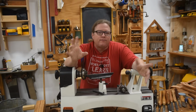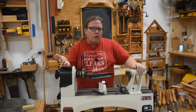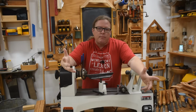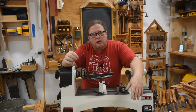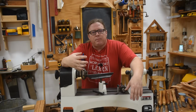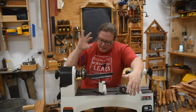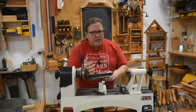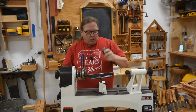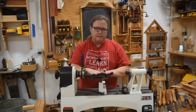Now, a quick review. In the first class of the series, I basically unboxed a brand new MIDI lathe, and that was kind of a prompt so I could discuss all the different parts that come with the lathe, their purposes, how to tune them up, that kind of stuff. I also broke out and told you some accessories that I think you ought to get right from the get-go, simply because it'll open up a lot more options for you to progress in this craft. Specifically, I talked about getting a good chuck, a variation of the live center or drive centers that came with the thing, a Jacob's chuck, and a nice luxury accessory would be an aftermarket tool rest.